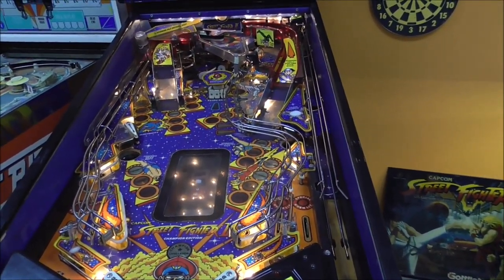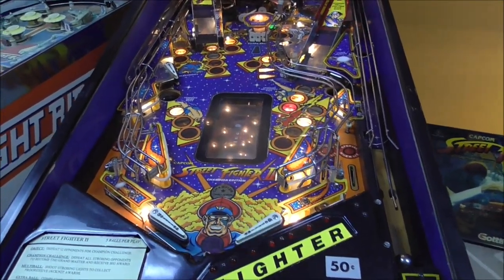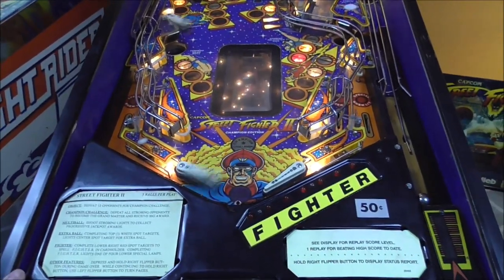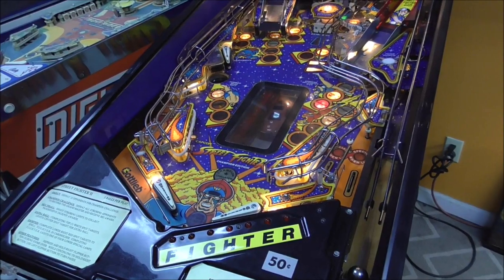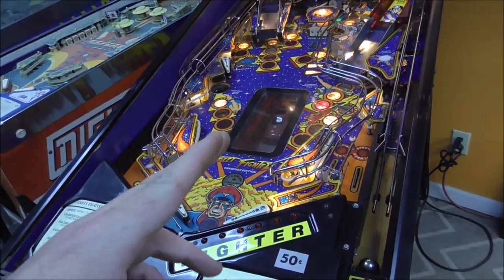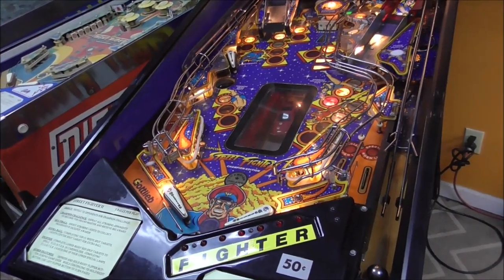Whoa, it's looking for a ball still. There we go. Ready. We're good again. It was the capacitor. So that capacitor was actually shorted. When I cut the lead off of it and measured across the things, now my short's gone.